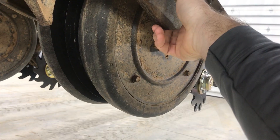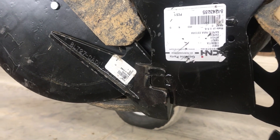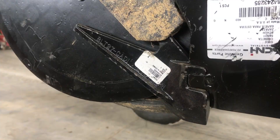The next great place to look is the gauge wheels. These gauge wheels should be tight against your double disc opener and should move up and down effortlessly without any gaps or flop to them. Remove the gauge wheels and take a look inside at the seed tube guard. That seed tube guard has two purposes: it protects the seed tube so that it doesn't wear, and it also prevents the gauge wheel from rubbing against the seed tube and creating vibration. If the seed tube shows any wear, you don't only want to replace the seed tube — you're also going to want to replace the seed tube guard.